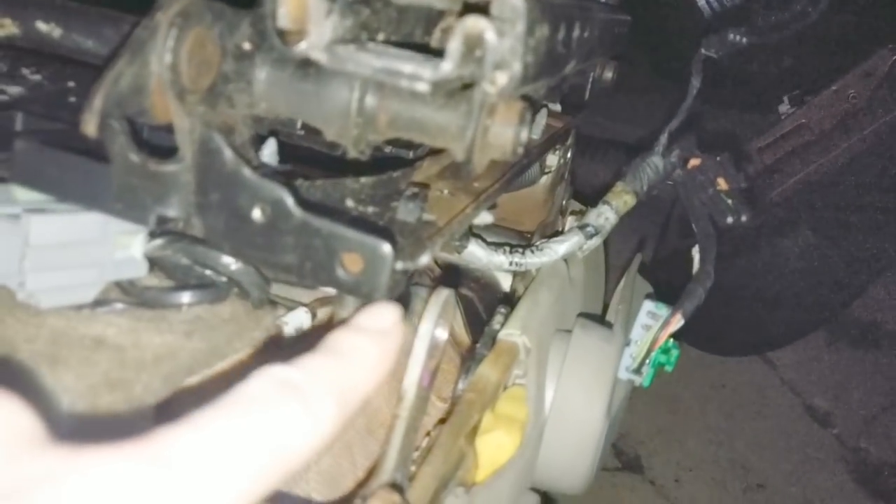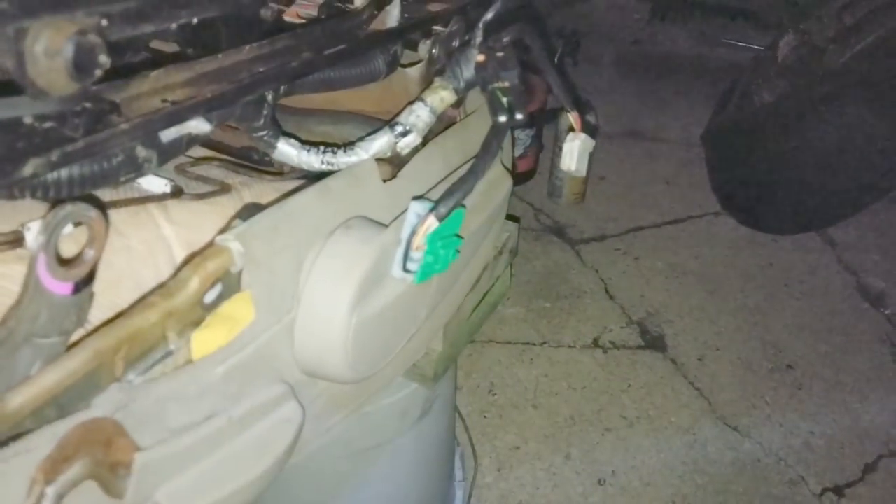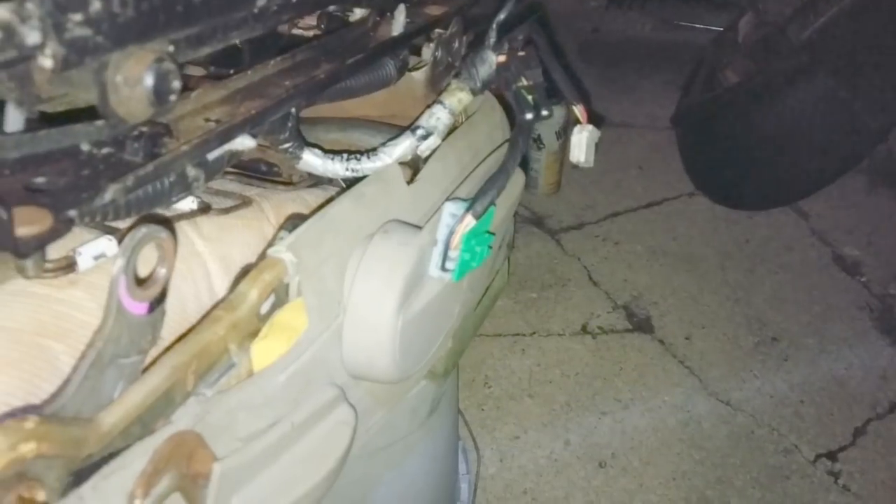Here is the bracket. The close side is going to be the easy bit — basically all we need is a little right-angle piece. We're going to have a flat piece that comes out and a flat piece that comes down, then drill a hole and pop it in there, and that should be good. Same on the other side, except we'll have two bolt holes instead of one — extra support.